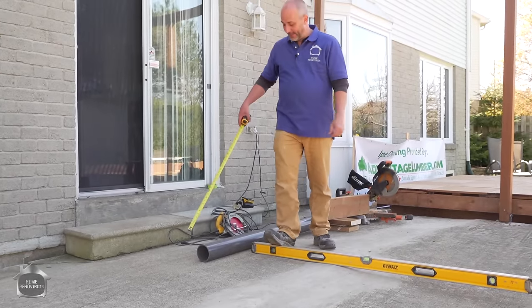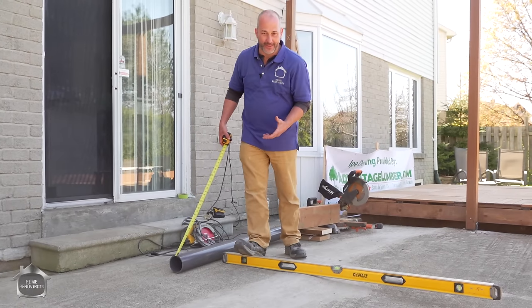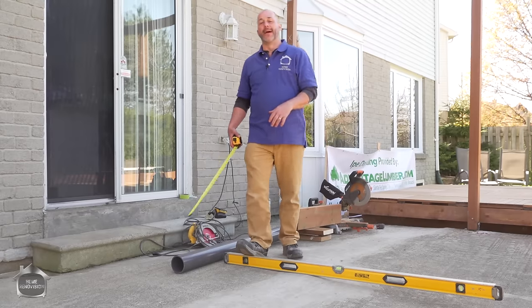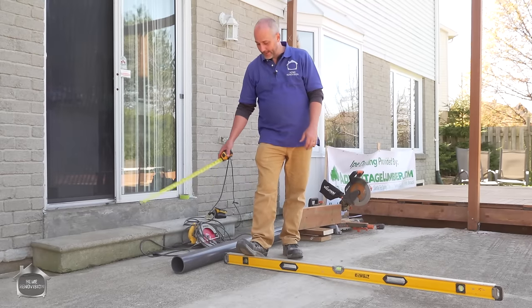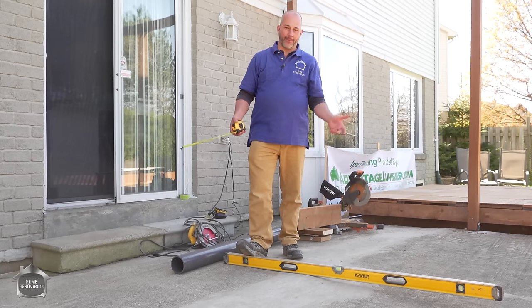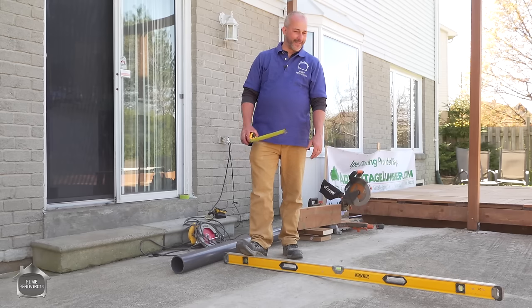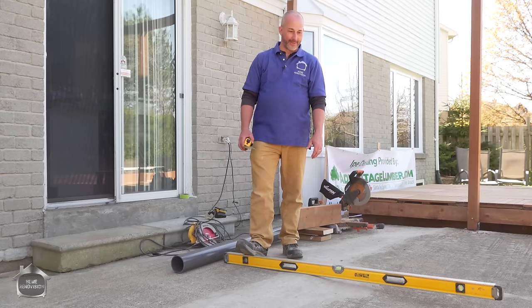I'm just joking. The reason they've got something so strong in their specs is because it's part of their structural component system for installing this on roofs, and it has to be all screwed together. And this will hold screws really well. The 4-inch PVC we have in our country probably will work as a support, but do not try to install that on a roof, because it will not give you the same kind of quality result.